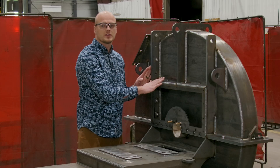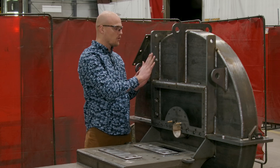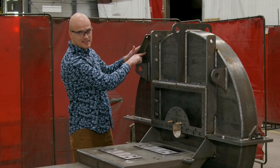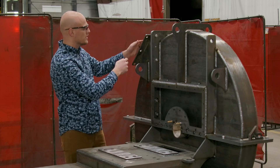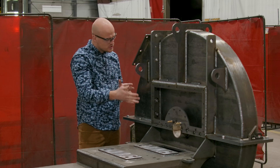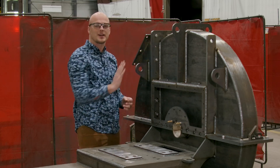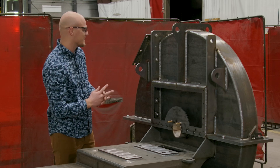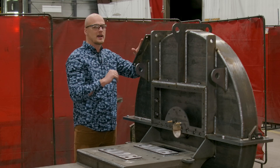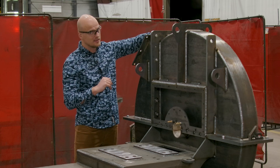Once this is sent to the field, you're going to be putting thermal insulation on it — likely four-inch thick thermal insulation. We have an extended access door right here, so the access door is pulled away from the housing. The insulation is going to wrap the whole housing so someone doesn't come up and touch a 900-degree housing, but you'll still be able to get at the internals through the access door, which will also have its own layer of insulation on the inside.